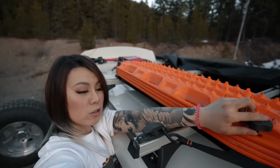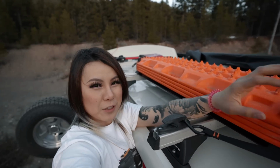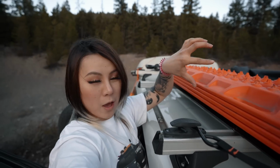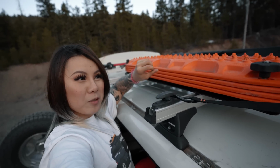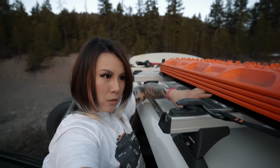There is one little thing: because I only used 1/8 aluminum, it bends and flexes a little bit, and it makes noises where the studs in the bottom contact the metal baseboard. So I put some foam tape where the studs are so that they don't make noises anymore.